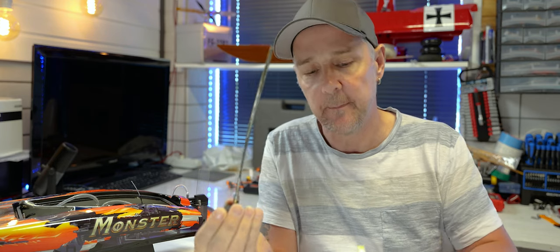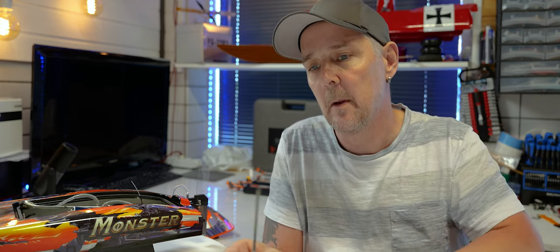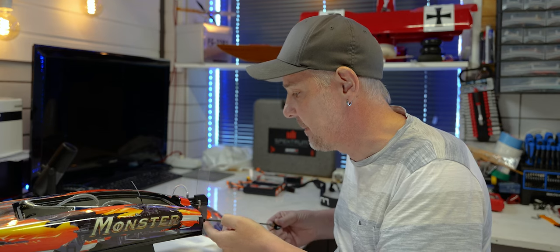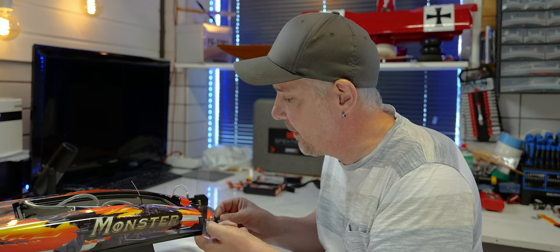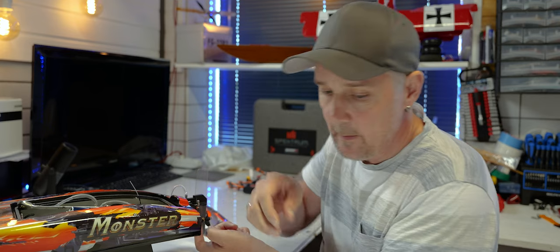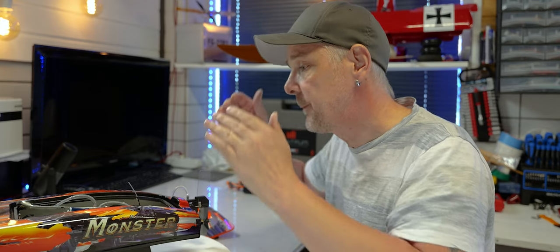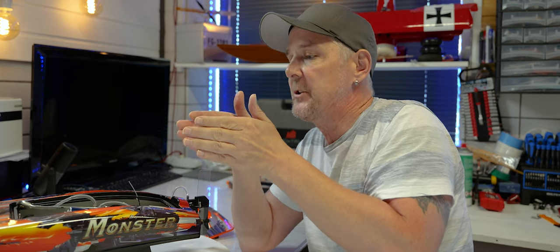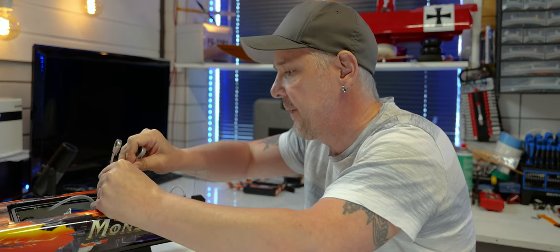Now you can see a lot of grease here. And now I will put this flex shaft back into the boat. A lot of grease will come out here. Make sure that we hit. And we can dry off the excess. Beautiful. Now we have to fasten the coupling again, because when you tighten this, it will put arms around the flex shaft.